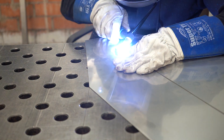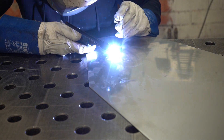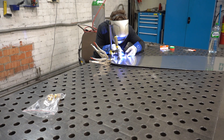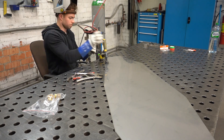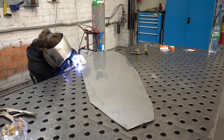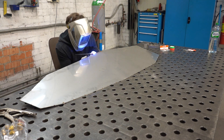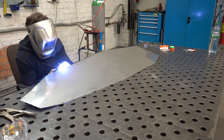And now you can see how terrible of a welder I am. I'm using a regular stainless steel nut for this application, mainly because I couldn't find any stainless steel plumbing fixture. So I decided to go with this regular nut and threaded the brass plumbing fixtures with the same thread. For whatever reason the plumbing fixtures come in imperial threads and the rest of the stuff is metric, as it's supposed to be here. Luckily I found a workaround and I was fine.